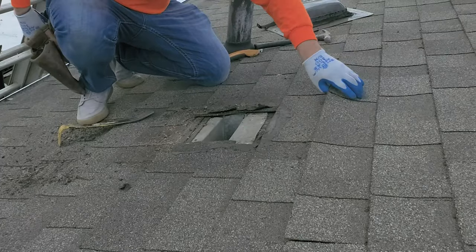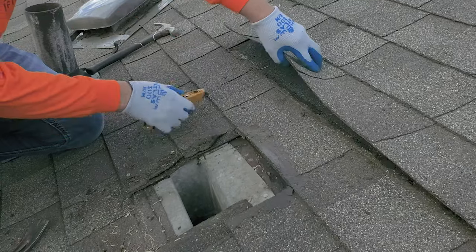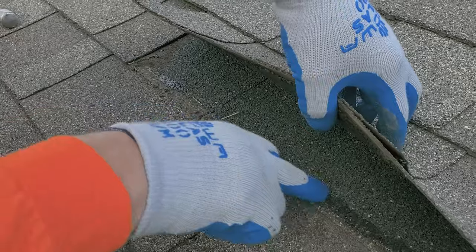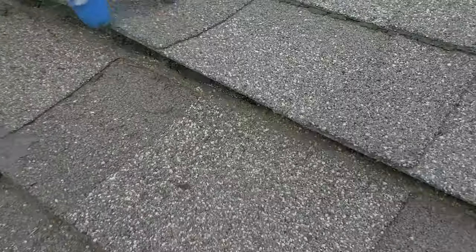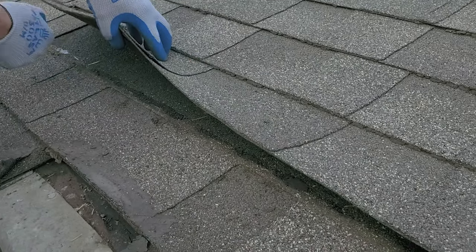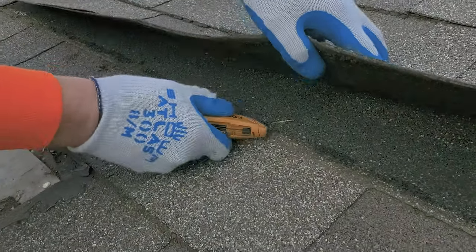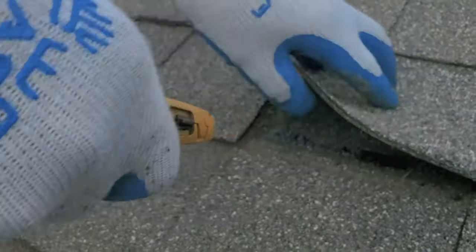If you come over here and look at these staples — look at the way they did these staples. If you ever do staples, which is never recommended, you want to lay them flat this way. See, there's another one right here. What happened was this installer had a rainbow effect — he started here with his gun nice and straight, and as he turns he gets crooked like that. But if you want to take these out, real simple: kick your hook knife in there and pull them up. See how easy that is?